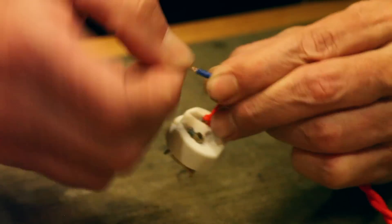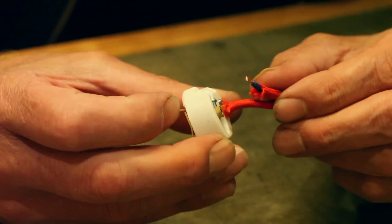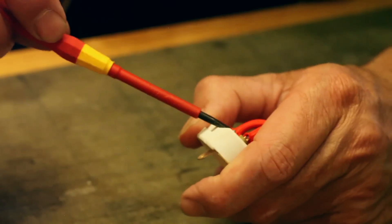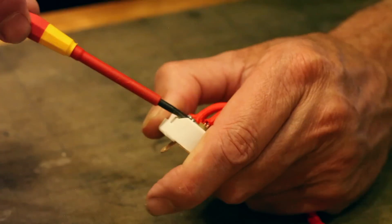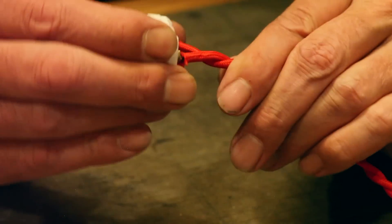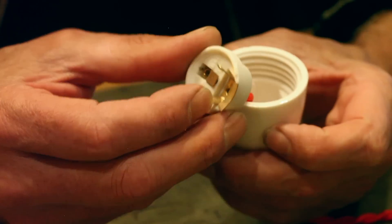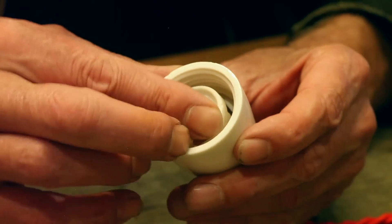Now we have the neutral — that's the blue. Twist and bend the wire. A lot of people don't do the little bend, but it puts a kind of barb on the end so when you insert it, it resists pulling back out slightly — as well as being a slightly thicker bit of cable, it assists during wiring. We get both wires on correctly, then push the connector back in. Note that this part isn't supposed to rotate either — it has a little square face that needs to line up with the internal square face inside.